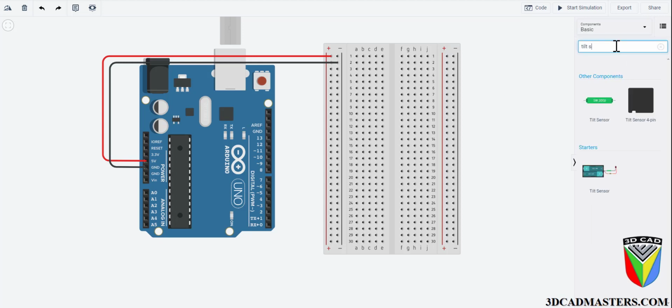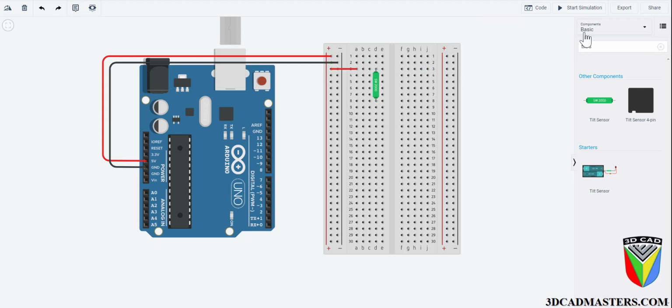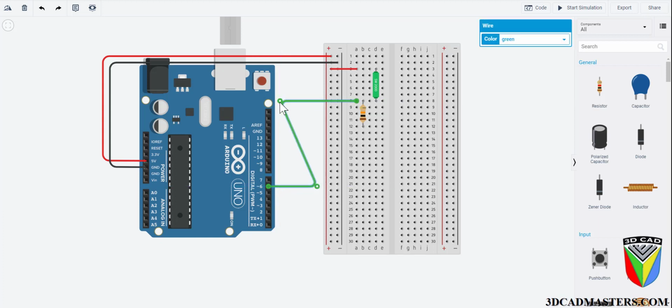Let's place a tilt switch on the breadboard. Attach one lead to the power with the red wire and the other lead to the ground through a 10 kilo ohm resistor and to your Arduino's pin 6. The tilt switch is going to look slightly different virtually and in person. The one in person is a lot more narrow, so you have seemingly more room on your breadboard.